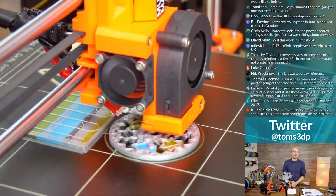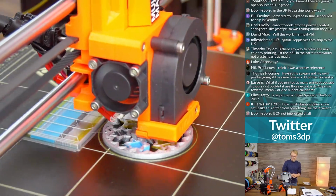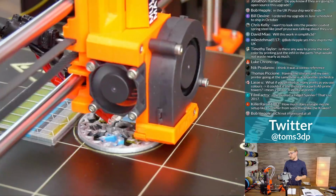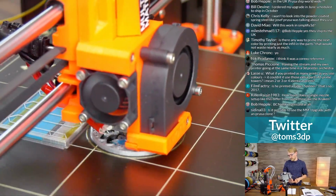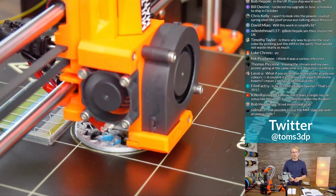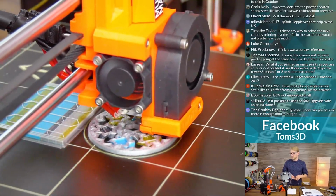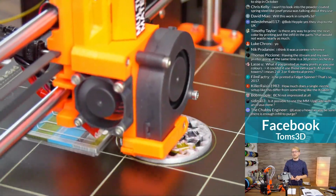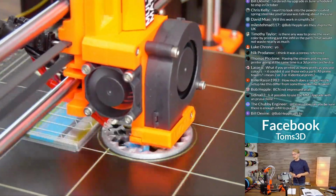But of course you have to worry about 2 nozzles now heating up and staying at temperature and boiling materials possibly. So this is more of a solution where you have something that works but uses a lot of material and you don't have to worry about it so much. But like independent nozzles, you will need to, like Ultimaker does, print a prime tower or have some sort of a bucket and worry about each nozzle individually. Just it's a different approach.